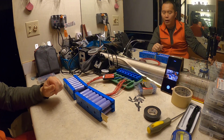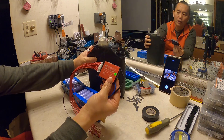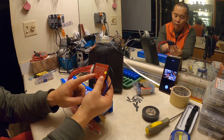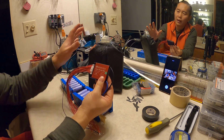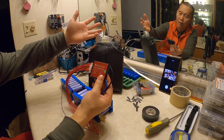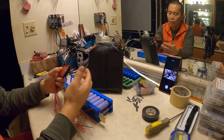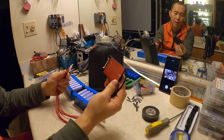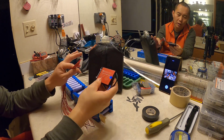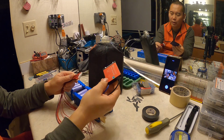In this video I'm going to talk about how to add a BMS board like this one. Basically this BMS only controls the charging part — I don't use it to control any load. Any load will be protected by this circuit breaker, which also works as an on/off switch for me. This way I can buy a pretty cheap BMS board; I don't need to buy something very expensive to control both charging and discharging.